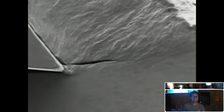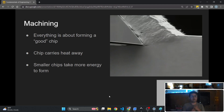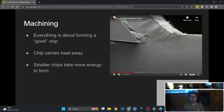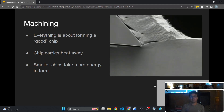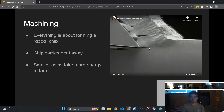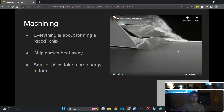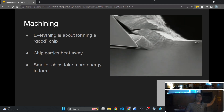What we're trying to do is slide this cutting edge through the material, take a chunk, split the actual bonds at the smallest point, and then bend that chip up and away to make our cut. This is how all mills, lathes, and shapers work — the fundamental essence of machining. By having that chip be a big, thick, solid piece of material, we're not breaking all the bonds inside the chip, which fundamentally requires less energy than grinding. Our base material stays cold while the chip heats up and carries that heat away from the tool.